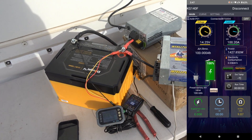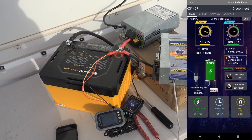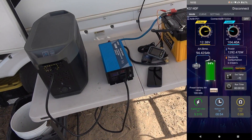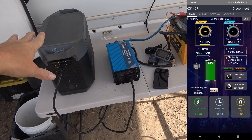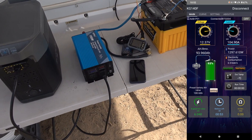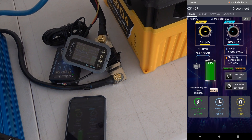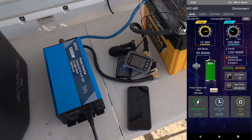I'm not going to charge it up at full 100 amps — the recommended is 50 amps — but I'll take one of these off and charge her up to full, then do a capacity test. Next, I wanted to test the rated max discharge rate of 100 amps. I've set up a power station I can adjust for input wattage, and right now it's putting out 104 amps on my meter. Letting it go for about five minutes with no problems — pass for its max discharge rate of 100 amps.